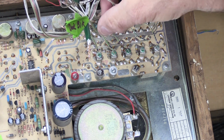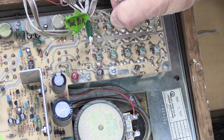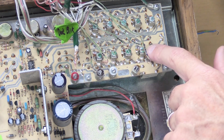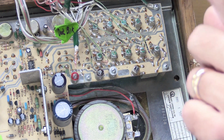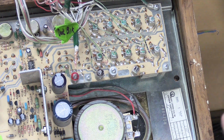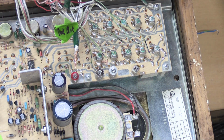The thing with the hash marks on the wires, for me and my company, was something that everybody that ever worked for me learned. Part of the idea of standardizing is that everybody knows we do it this way. Everybody understands what the hash marks are for, and anyone can go back and put this set back in and understand what this means. So standardizing is a good thing. Don't be all over the place with how you do things. Be consistent because it makes your life easier.